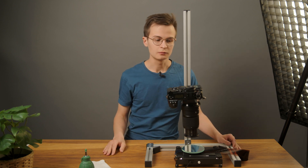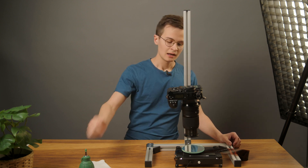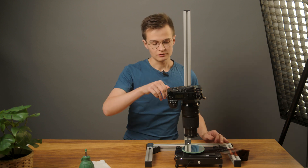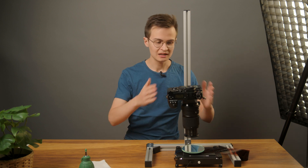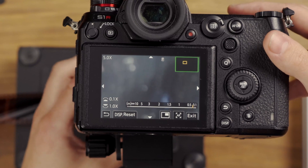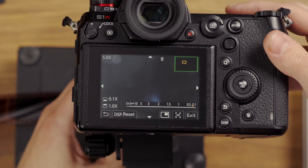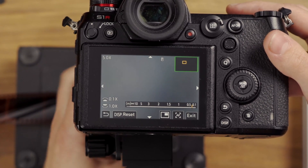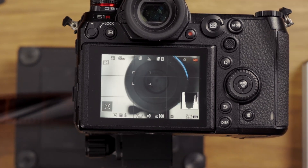Through a little trick of optics, we are going to align the center of the aperture, which we can look through, and just align the center of the aperture with itself, since we can see a reflection of the camera. Now it's a bit blurry, so I'm just going to focus it. It will be a bit difficult to see, but we can focus it. Because it's twice the distance — the distance from the film to the camera — so the light is going to bounce up, going down, and then up again; it's twice the distance.